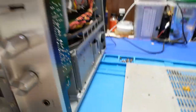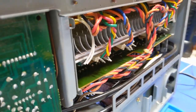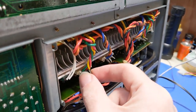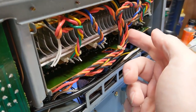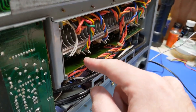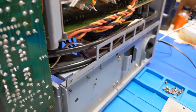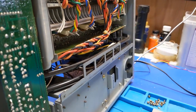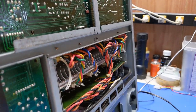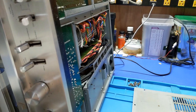The second thing we have to pay attention to on these amplifiers is back here. Now that I got the rear cover off, right on this heat sink are the power transistors for each channel. The Achilles heel of this design is these right here — they socketed the transistors. That one's kind of hard to tell through the camera, but it was kind of tight. Look at this one — that one's broken. It's cracked, that one's getting there. The only way to fix this is to actually physically solder the wires directly to the transistors. That makes it harder to remove, but it's the only way to fix that problem properly. I still need to test those and see if they're actually still good because there could be a shorted transistor in there.